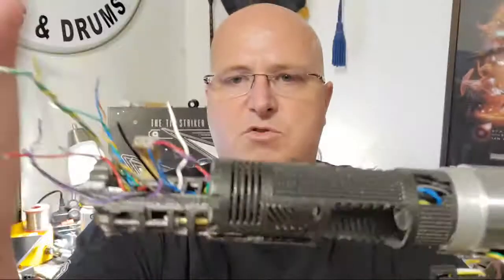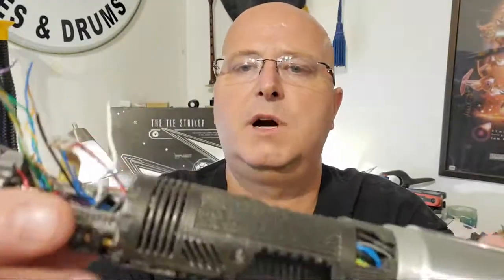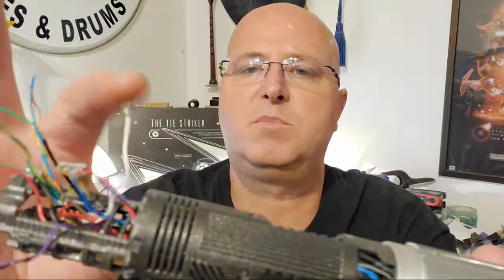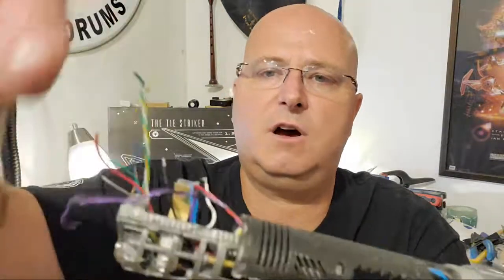And all that looks crazy, but these are all my raw wires. Like, for instance, I know those are my switch wires. These are my accent LED wires. These are my NeoPixel wires. The blue wires there are my speaker wires. This is board negative. This is NeoPixel negative. And my board positive is right there. So I know what all those wires are. They're just ready to go to their place on the Proffie that I just showed you, and this board will be ready to install.